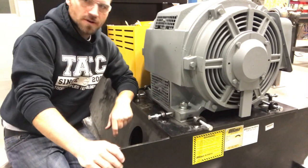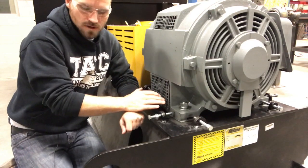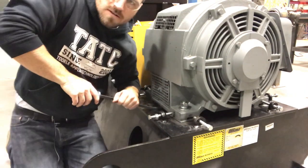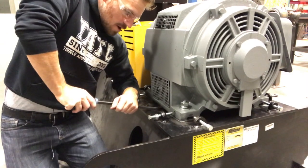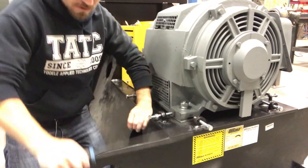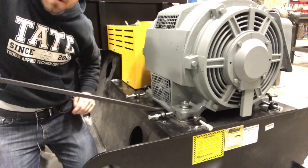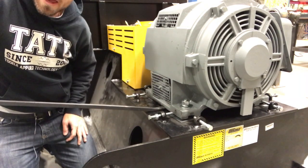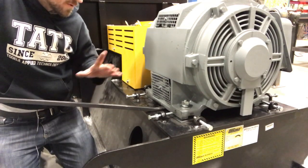A very popular job you're going to need to do is put shims underneath a motor — this motor weighs about a thousand pounds. To show you leverage in action, I'll take our shorter pry bar and you can see how much more difficult it is to lift it up. I'm still getting it up there, but now I have to hold it with one hand while I put a shim in, which becomes very difficult. With this longer bar, I can easily with one hand push it up, slide my shims under, and be done — working smarter, not harder.